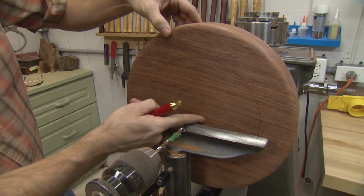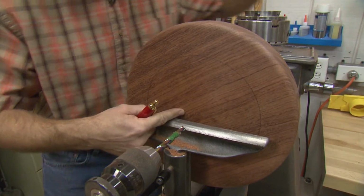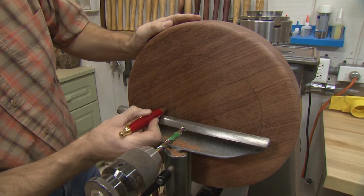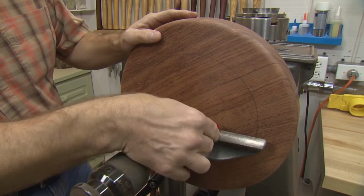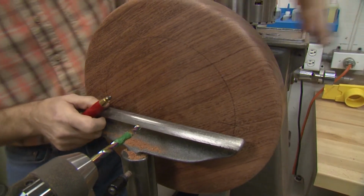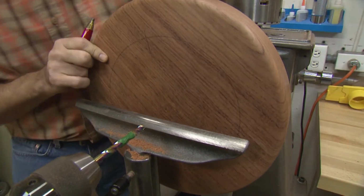Now, this is going to be a little bit odd. Here's my grain. I'm going to turn it 1/4 of a turn. I'm going to lock this in. I have a nice way of locking that in on my lathe. I'm going to come here, draw a perfectly level line. I've set my tool rest to be dead center. Now I'm going to take this and rotate it here with my spindle lock, my indexer, and lock it in.